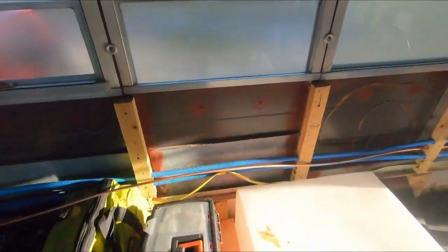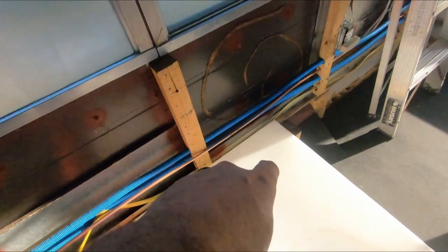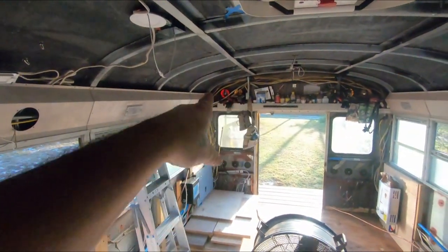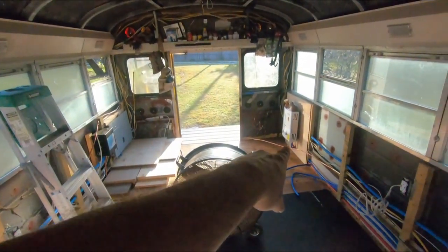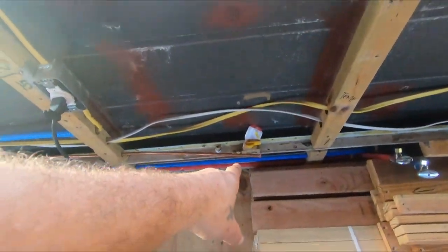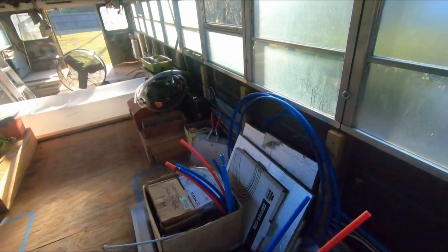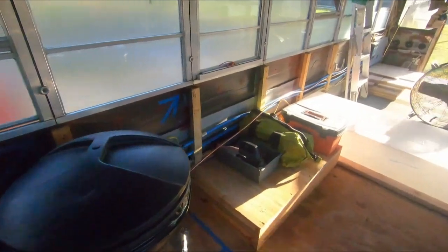We'll come over here. Down there, I've got to tee off that copper propane line and go down into my under storage, cut it off here, couple it in the back wall there with the one that we ran halfway down to the water heater, put a cutoff valve in there, hook this flare up here with a cutoff valve from my stove, get our shower valve installed and shower head suspended there. And let's see, yeah, everything else is run.